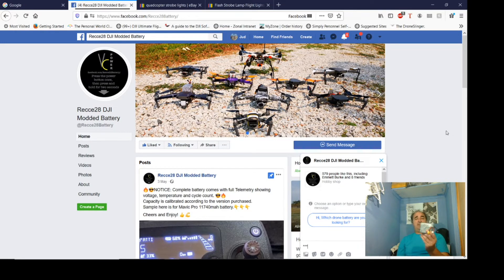The bad cell happened because I charged the battery and left it for about two weeks fully charged since the weather was terrible. It did auto-discharge, but because these are bigger batteries the DJI discharge level isn't sufficient. Vincent recommends keeping at least 50% charge if you're going to leave it stored for any long period. You can use the side plugs to connect to a charger and discharge it, or just plug into the quad, leave it powered on, and let it run down to 50%.